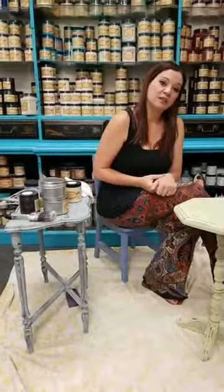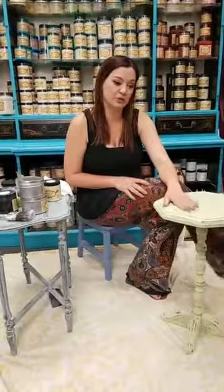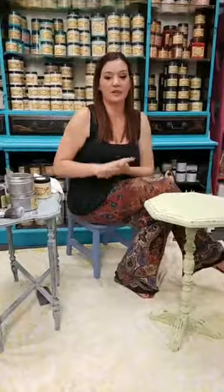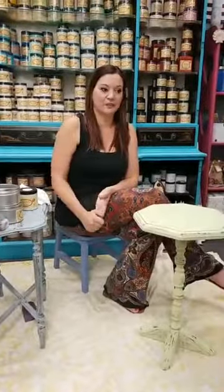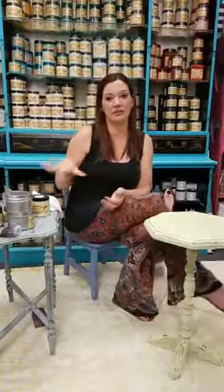Unlike ordering online, you can come down to your local retailer any day of the week and they're ready to help you and teach you. We keep extra wood in the back and will walk you through any step you're unsure of. Someone asks: would you recommend Gator Hide for a vanity top, and what top coat for the sides and legs? You could put Gator Hide on the top since that gets the most use, and wax the sides and front. For a vanity I'd definitely Gator Hide the top — makeup spills, perfume, cleaning — it's going to get used and washed a lot.